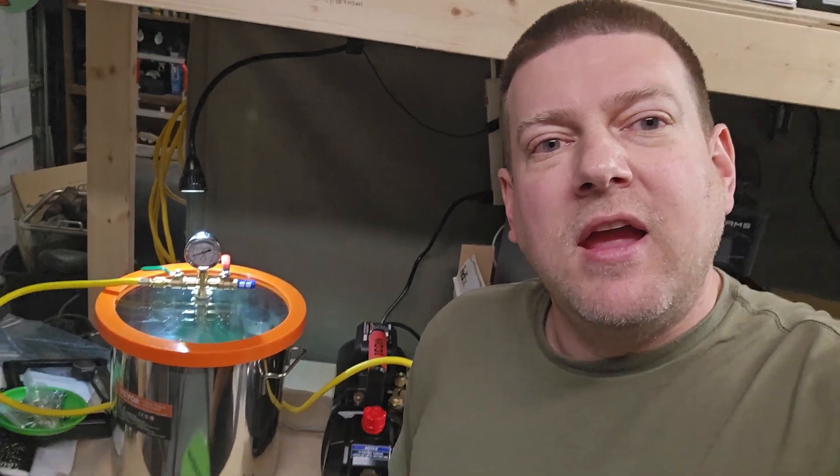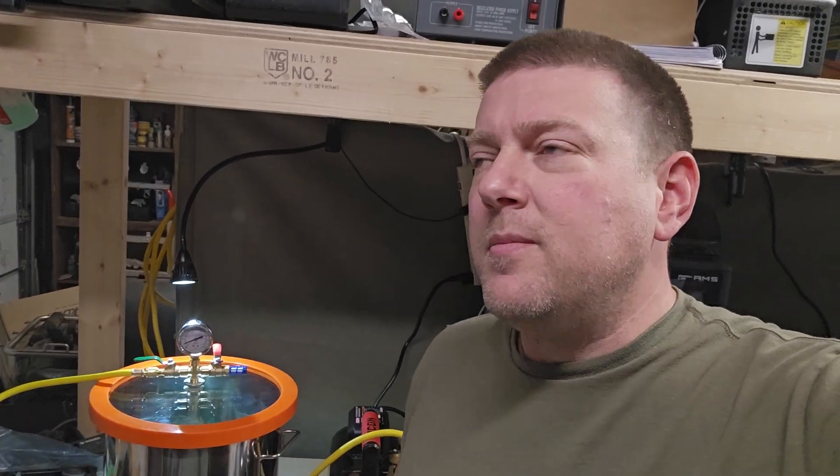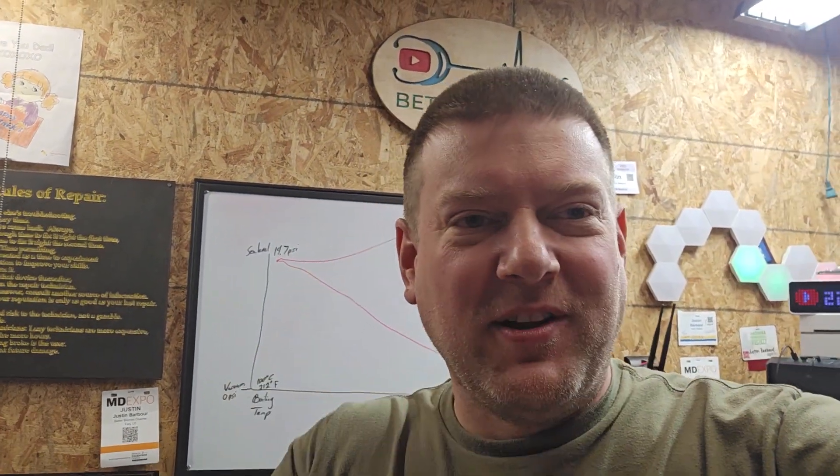There you go, folks — just a quick demo. I'm experimenting with a new device because I want to be able to thoroughly clean circuit boards and save things like phones. You put them in a vacuum with a slight heating source, and you can easily boil out all the water on the circuit board, including the stuff hidden under SMD chips, which is extremely difficult to remove thoroughly. Place it in a vacuum on a heater and leave it for an hour or so — it comes out perfectly dry. Thanks for watching, folks. That's a little demo on physics, water, pressure, and phones with water damage. Hope you learned something.